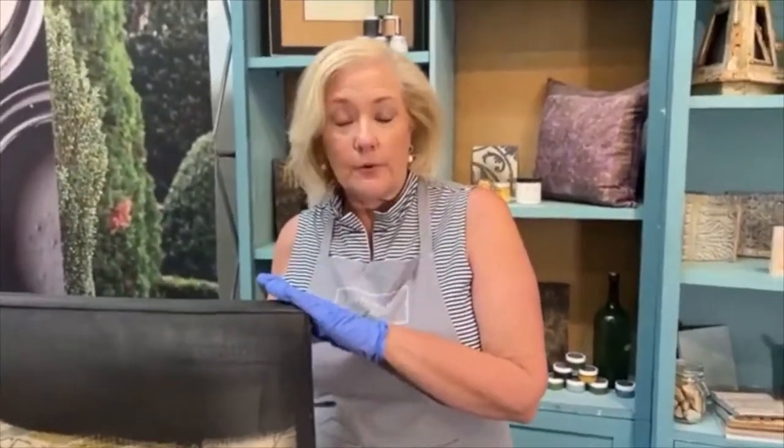We've got some beautiful heat here today, so I'm going to be able to set it outside for it to dry faster. But on average, around 6 to 8 hours. Then lightly sand it with 400 grit sandpaper, brush it off. Then we're gonna put on the second coat, do the same thing again, and I'm gonna test it.